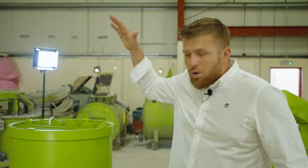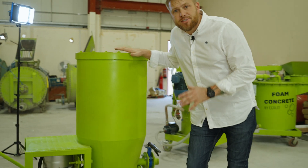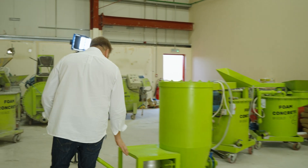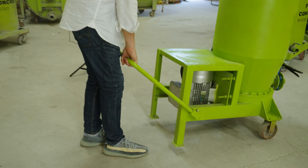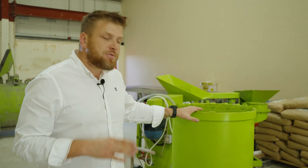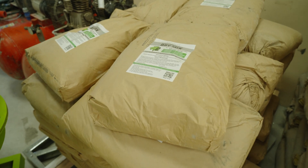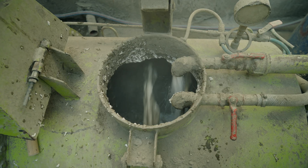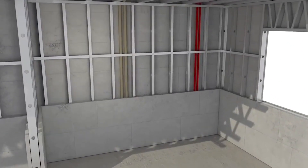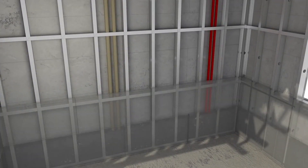We have a new option here — it's a very small 200-liter capacity. The tank is only 200 liters and especially useful for one operator. It's easy to shift, easy and suitable to install in any kind of apartment, especially if there are lifts or elevators inside the buildings. This is a very compact mixer — it mixes cement, sand and some other recommended components together, giving us a low density result starting from 100 to 300 kg per cubic meter maximum.